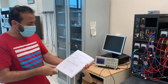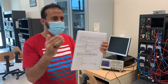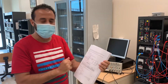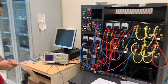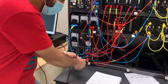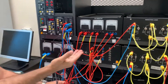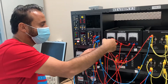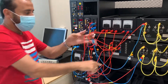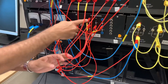We are doing the three-phase half-wave uncontrolled rectifier, which uses three diodes. We came from the power supply to the AC meters — because we want to see the AC reading — and then from the AC meters out to the power diodes. We connect three diodes: diode one, diode two, and diode three.